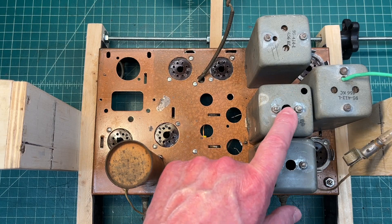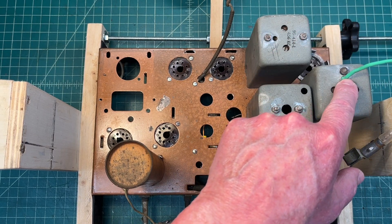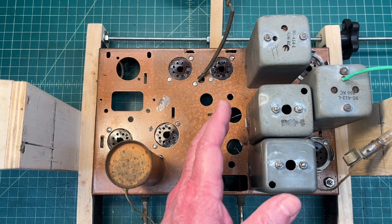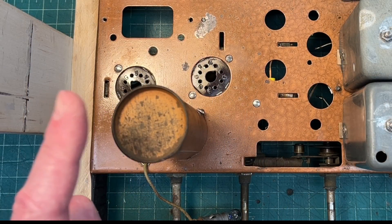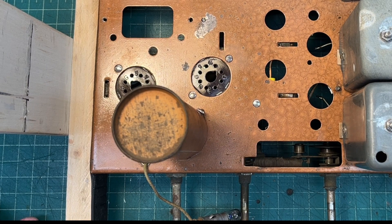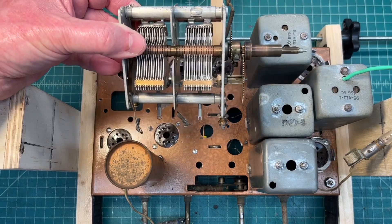I'm still trying to decide if I wanted to pull these filters out. Where the wire was frayed on the grid wire, I just put some heat shrink on that, so I may pull these out as well. A little more cleanup on the cans and I'll make that decision. I'll also look to see if I'm going to restuff this capacitor can — it's probably an old dry electrolytic so I may use that space and free up some room underneath for the new E-caps. You guys saw the tuning condenser — it cleaned up really well.